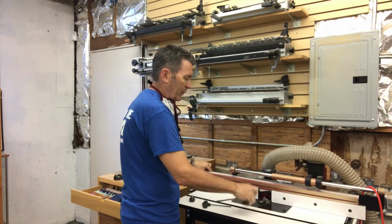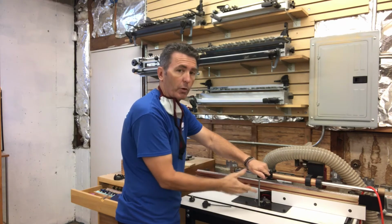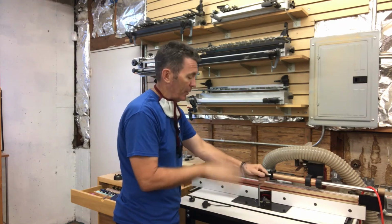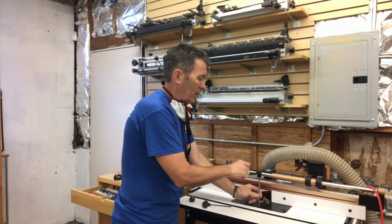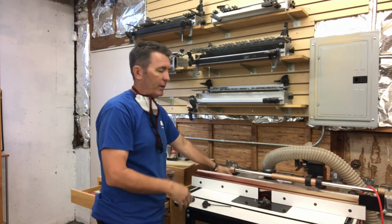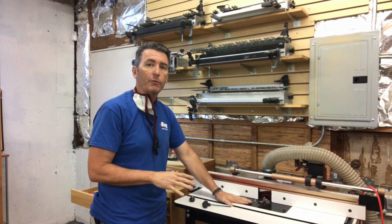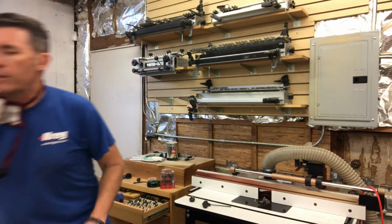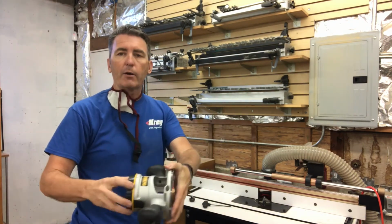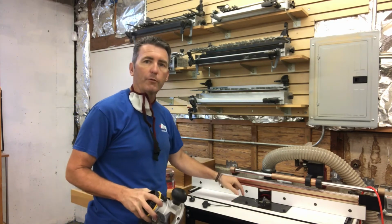This thing's in the right position where I've got it up and down, and I can micro adjust to a 64th or 128th of an inch at a time, up and down. You get it set to where you want it, and then start the testing process, and then off you go. Beautiful. These router lifts have made life tremendously easier than trying to use the adjustments on the outside of these router bases. Those are much more difficult to get perfect. This router lift makes life great.